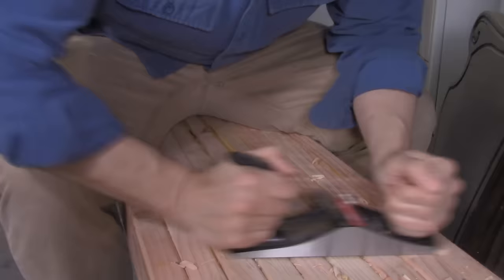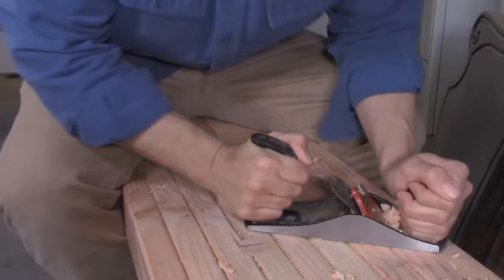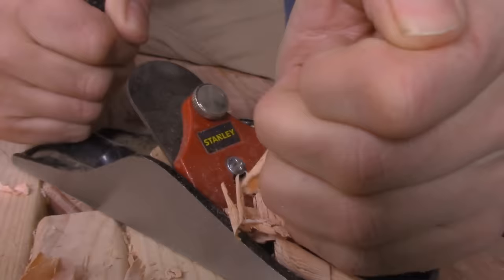When I first glued this bench up, I was mostly concerned with getting the straightest glue joint possible, so I didn't pay much attention to grain direction. As a result, when you're planing you might get some bad tear out in some sections — you're probably going to have at least one or two boards heading in the total opposite direction. When this happens, flip your plane around and pull it towards you instead of pushing. That'll probably solve a lot of the tear out issues.